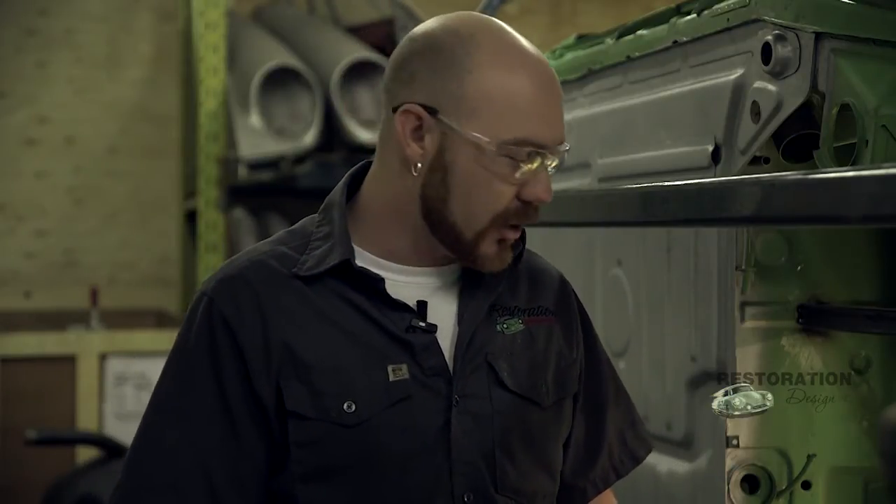We've taken care of all the prep work. I've ground down all the spot welds and cleaned everything up. There were a couple of small areas at the back of the seat back that needed to be replaced and I took care of that — it was a bit of a challenge to get into that corner. After I finished, I put some POR-15 on the area that's going to be covered by the suspension console in order to reduce or even stop future rust from happening inside on the frame.